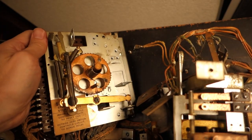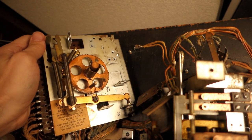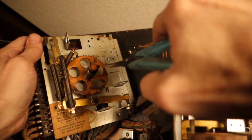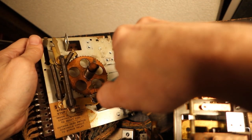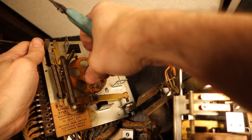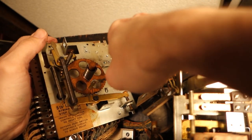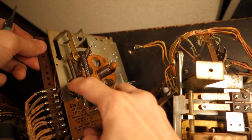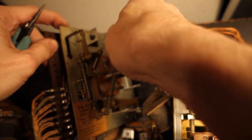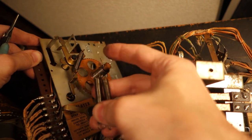We'll pull that spring off. What's neat about these units is the spring is held up top here, and this pin will keep it from ripping itself off when I let it go. So I just bend this a little bit out - there's a notch in this pin - and there. There's still tension on this spring but it has been released here. This wheel will turn. These two springs - I believe they're the same. They feel real similar.